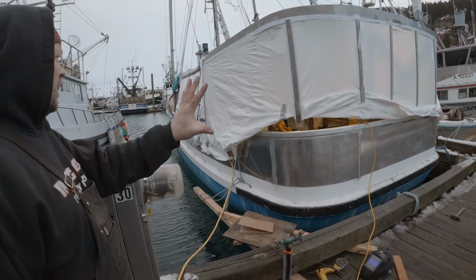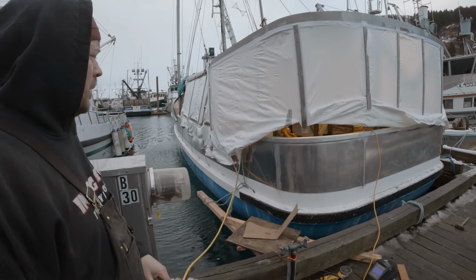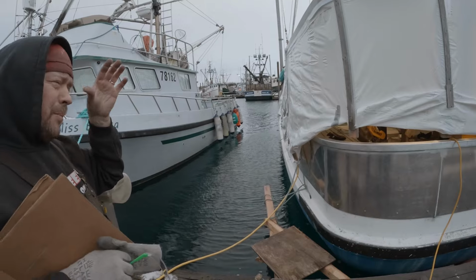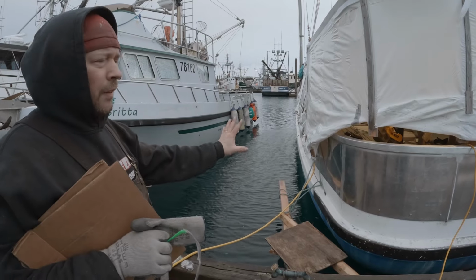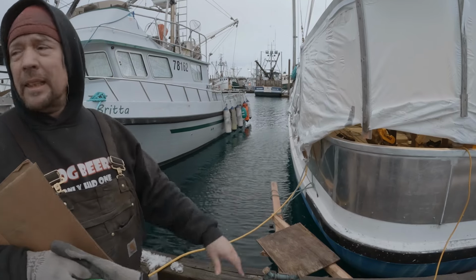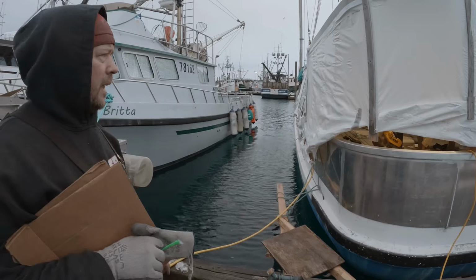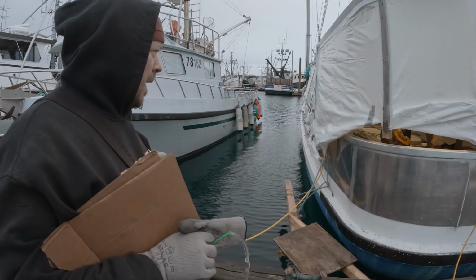There's some of the mill finish on this stuff. You could take sandpaper or something and just go in the same direction and hide that too. But right now this is really shiny, so you pretty much see everything because it's still got enough of a mirror finish or reflection that you can pick up that stuff really easy. Once this stuff oxidizes, it'll be really hard to see the imperfections. It'll just blend in as a gray kind of matte, and it'll pretty much be invisible at that point. But yeah, pretty happy with that.